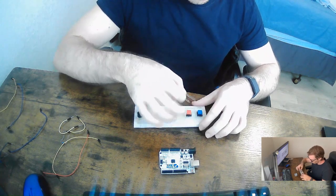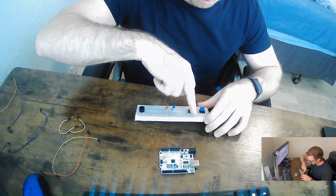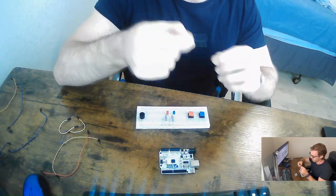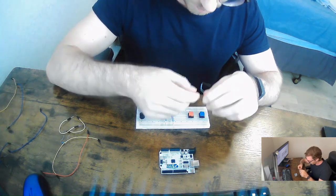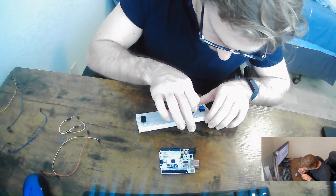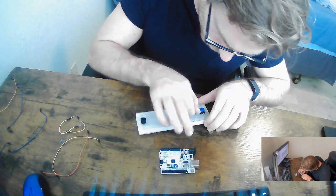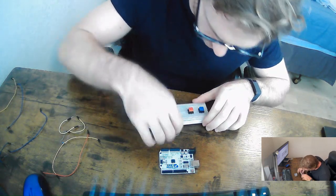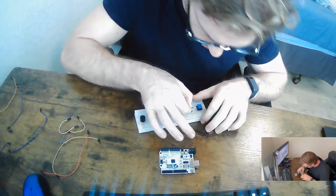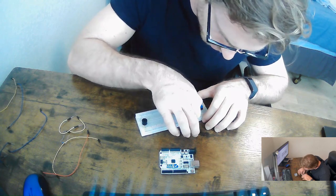So we're going to span this on one side as the negative. On the button, one side is a positive and one side is a negative. So we're going to drop this resistor on the negative side, just like the buttons. And so I'm placing it in row 15 because that will be where the negative side connects. And then I found placing these to be very difficult.